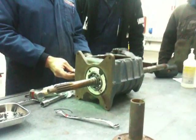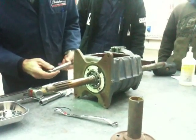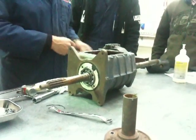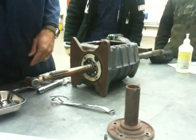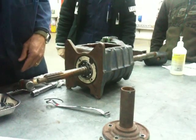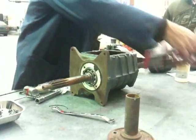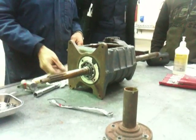We're going to actually see if these have been ground to the correct size, which I'm not completely convinced about. We're actually going to drift this out and try to follow this one through. If it's the right size, it'll hold inside there. It's filled up with lots and lots of little needle roller bearings - there's probably 70 or so needle rollers in there.